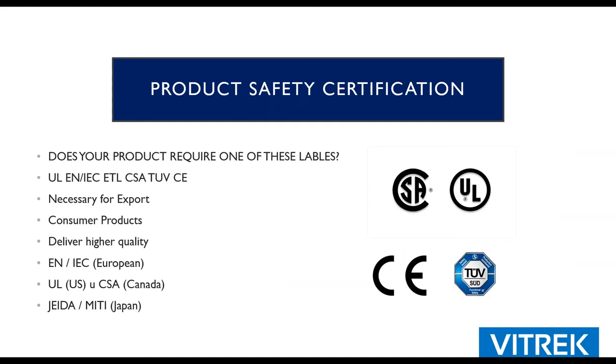You see these labels all over the place — UL, CSA, CE, TUV, and a handful of others. These will typically be on products with a four-digit number next to them, verifying that product has been tested to a very specific set of standards. You'll have a hundred-page standard going through safety from balance and weight to RF and all kinds of things. There will be one section on electrical safety — and that's really the part we specialize in, where you'll need a hypot tester to perform those tests.